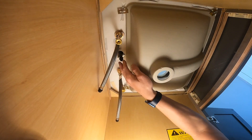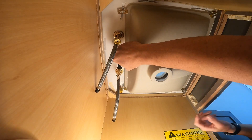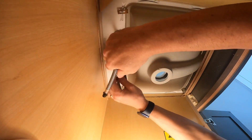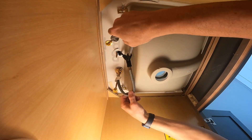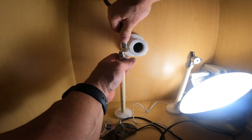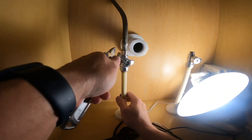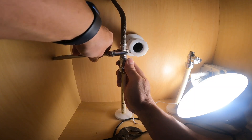Let's hook up the handles to the actual faucet assembly. You just push like so — you want to hear that click. The directions say just bend this line, and then you click. Same thing for this one — bend this line and it clicks. That's pretty straightforward. Now we'll put the speedies on. I don't really tighten these up much — just nice and easy, nothing crazy. I'm going to take two wrenches and tighten just a little bit. Not too tight — I let the washers do the work. I see people over-tighten these all the time. No Teflon, no silliness.